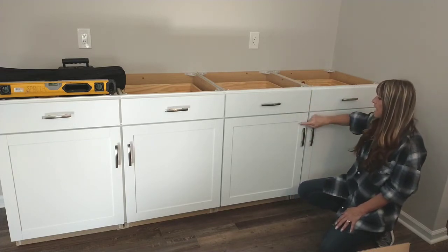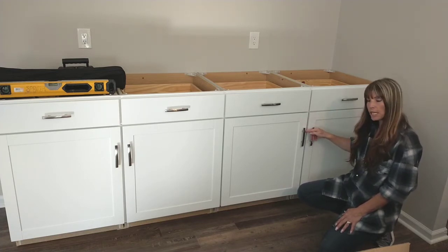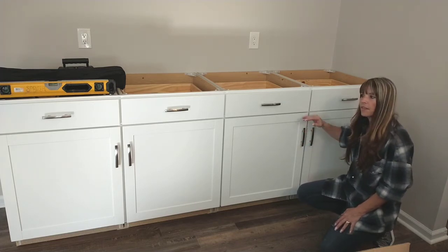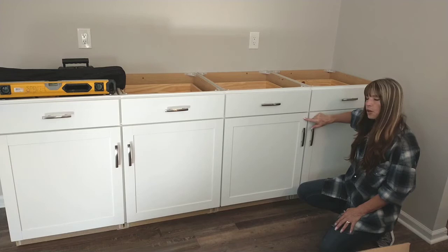And then on this, I found center, which happened to be 1 1/8 inch. And I went down 5 inches here and then an extra 3 inches here. Made sure they were 1 1/8 inch. Typically, I don't put door handles this low. I actually put them somewhere up around here starting.